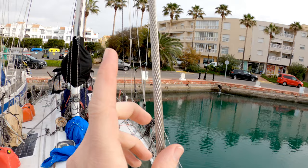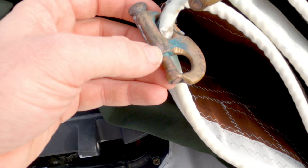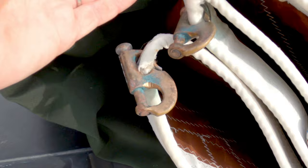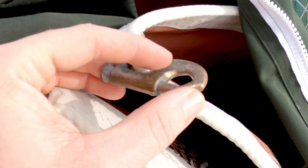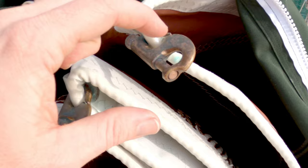Those notches are not from the bronze hanks, because bronze is actually softer than stainless steel — the bronze gets chewed away instead. If you look at a hank, you can see how the bronze is notched and chewed up because the stainless steel is sharper and stronger. So bronze hanks are actually disposable and consumable. The more you use your sail, the more they wear out. As they wear out, your stay is protected because the bronze hank, which is easily replaceable, wears out instead.